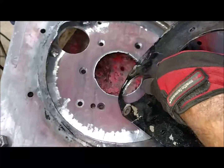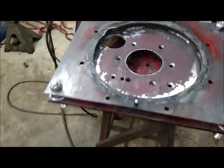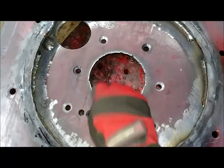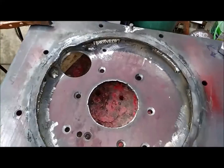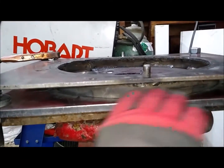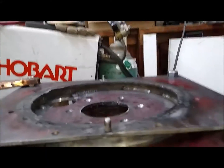That's another hand cut with the plasma and coffee. I had to do countersunk bolts because of the thickness here to clear the flywheel — that's where the starter bolts up. Then I got the right spacing and I'm just going to weld this ring in here. Rolled the ring out on the old Harbor Freight ring roller, and away we go.